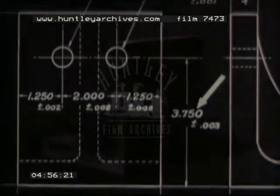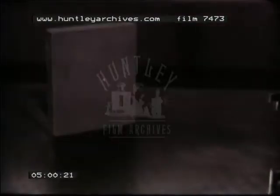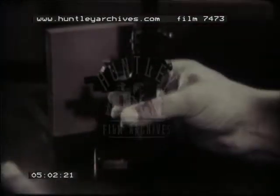The casting has been machined on its surfaces and is ready for the layout of the holes. A scribing attachment is fastened securely into place on the height gauge.